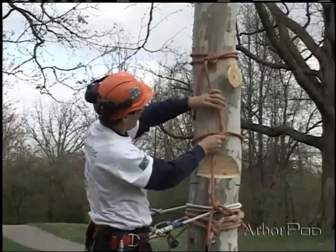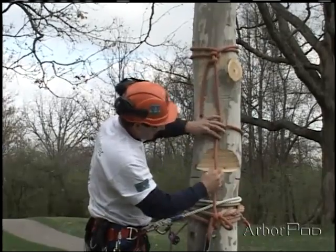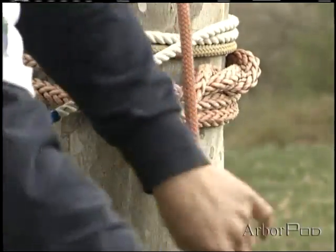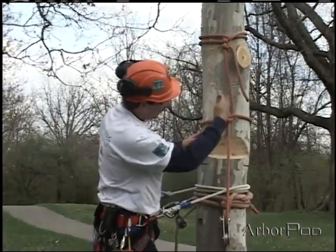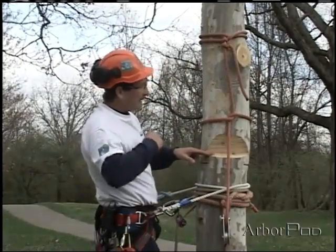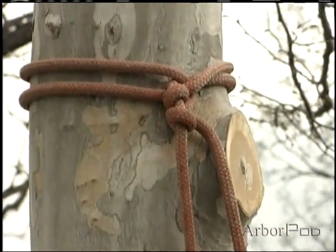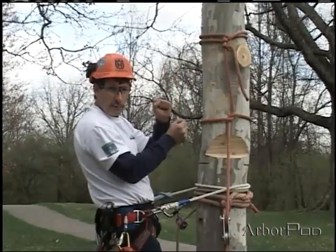And my marl — I want to make sure that the line is lined up right in front of my notch. The block is also in front of my notch. Then I remove my slipknot. Notice that my rigging line and my block are lined up right in front of my face notch. And as I make my turns around the stem to tie it off, I always turn around the stem in the same direction.